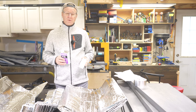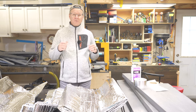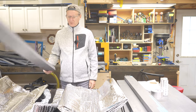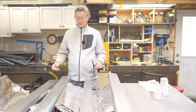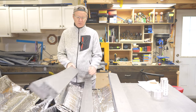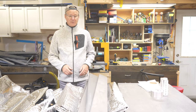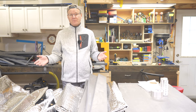One last pro tip — I'm going to show you what you can do with the leftover Styrofoam SM. A lot of my leftover pieces are about three to four inches wide in four-foot sections. I'll lay them out on the bench, tuck-tape them all together, then roll them up and store them overhead. Anytime I need to cut a four-by-eight sheet of plywood, I can use this leftover inch-and-a-half SM as a cutting surface. It gives you a great thermal break on your doors too — finish it up with some reflective foil insulation and you'll be laughing.